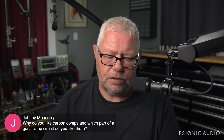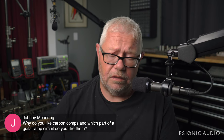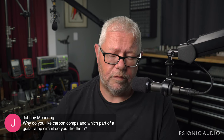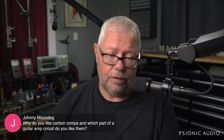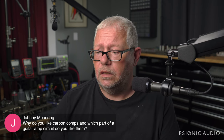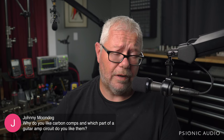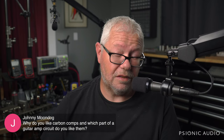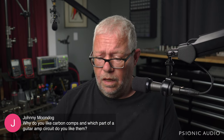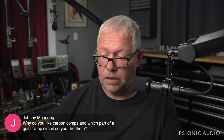See my videos on Fender restorations, just as a nutshell. If I get a '63, '67, or '65 Fender in, I put in carbon comps in the part of the board where the audio path was. I put in different resistors for the power section and bias supply, because that's where carbon comp is weakest. The place where I would never use a carbon comp in a power supply is exactly where Mesa does use them. If I get an old Vox or old Marshall, I will usually use carbon films, except for some very early and transitional Marshalls that did use carbon comps.